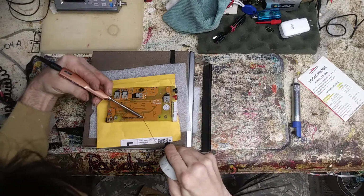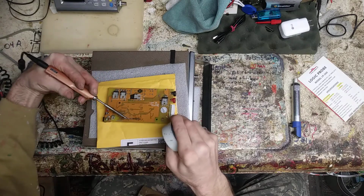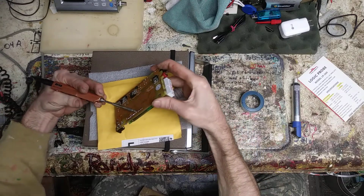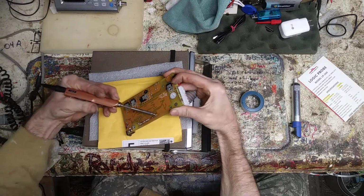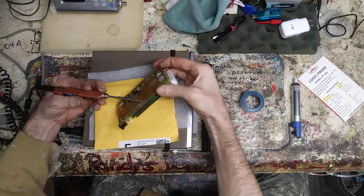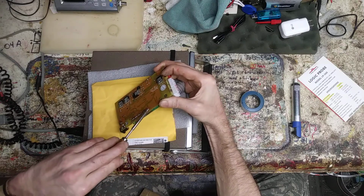I'm just laying solder in, and I'm just gonna keep heating it up, and just gonna walk the board right out, because solder sucking, solder blowing, solder pitching a fit ain't cutting it. So I'm just gonna get my finger under the board and just keep working it back and forth, and you'll see it'll just walk right out. I do this all the time with everything because I'm too cheap. I don't like to buy stuff. I like to recycle.